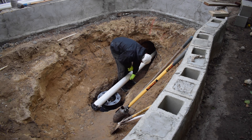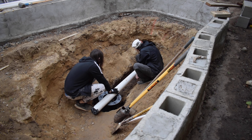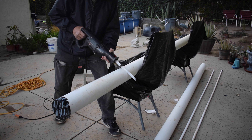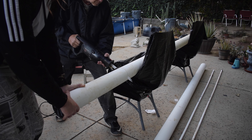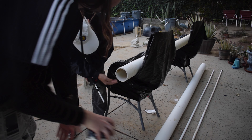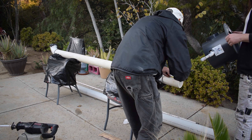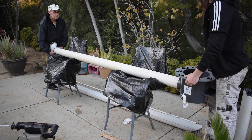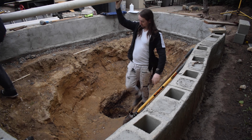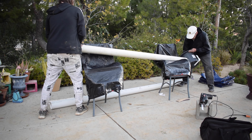Next we put the four-inch PVC pipe and the half-inch PVC pipe back into the trench to take measurements and cut the pipes to size. My dad used an electric saw with a blade meant for cutting fiberglass, which made a really clean cut. He sanded off some of the shavings on the end of the pipe. We then dry-fit it with the bottom drain, test-fit them in the pond, and they fit perfectly. We separated the pipe and the bottom drain again so they could be glued together.